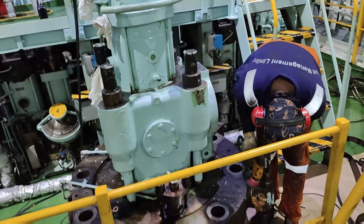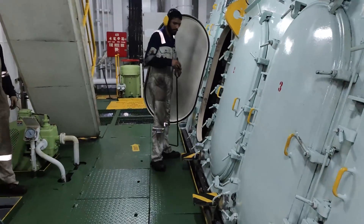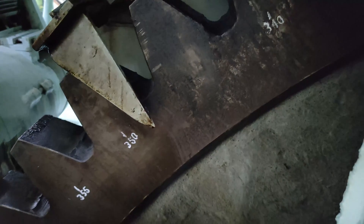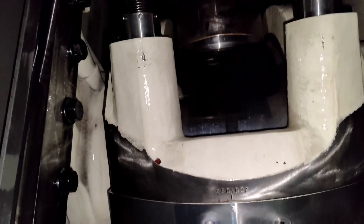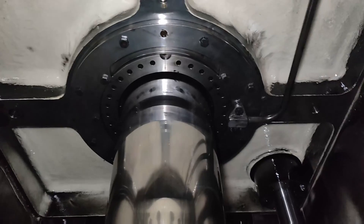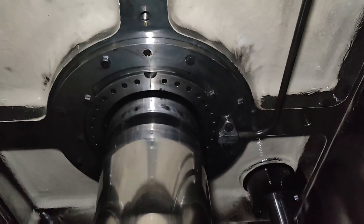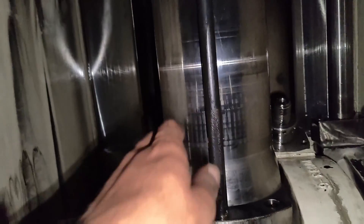Land the cylinder cover on a couple of wooden planks and clean all the pipe connection surfaces. To start the preparations to pull out the piston, open the crankcase door to the concerned cylinder. Turn the crosshead down far enough to give access to the piston rod bolts and the stuffing box. Loosen and remove the seizing wire and bolts connecting the piston rod to the crosshead. Then release the stuffing box by removing the innermost screws from the stuffing box flange. Also disconnect the drain pipe on the stuffing box. Never remove the outermost screws from the flange of the stuffing box. Then mount two distance pieces on the piston rod foot to protect the lower scraper ring and to guide the stuffing box while removing it from its housing.